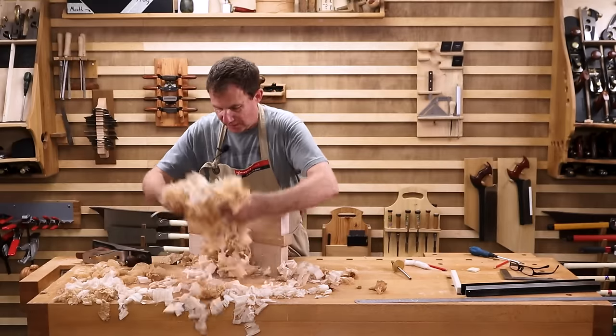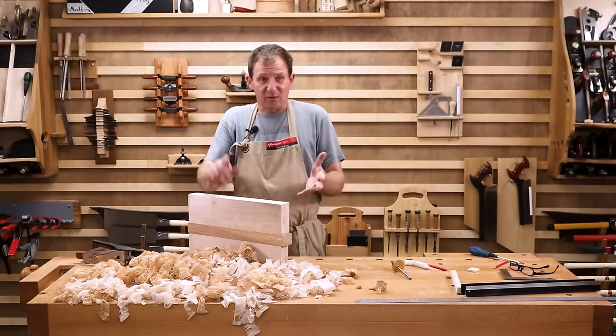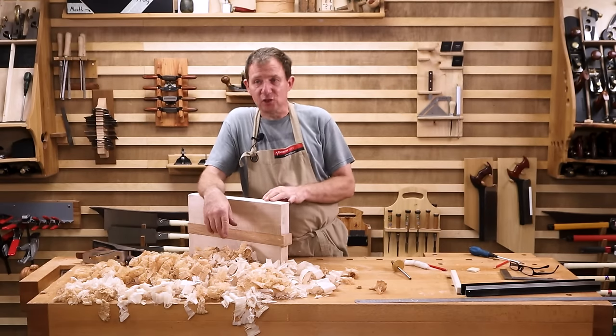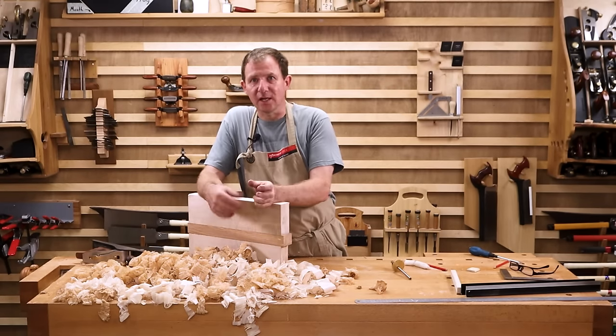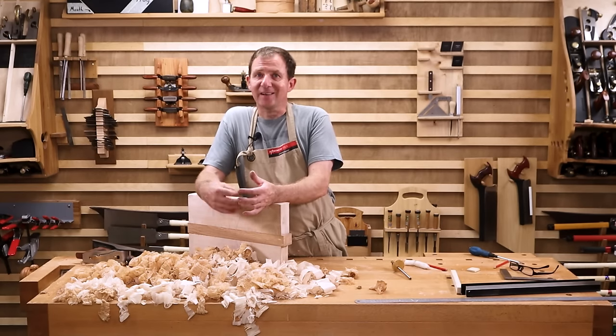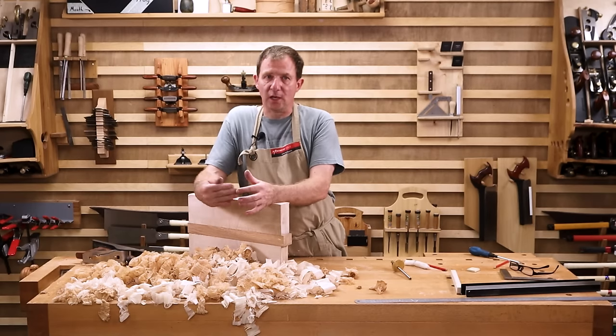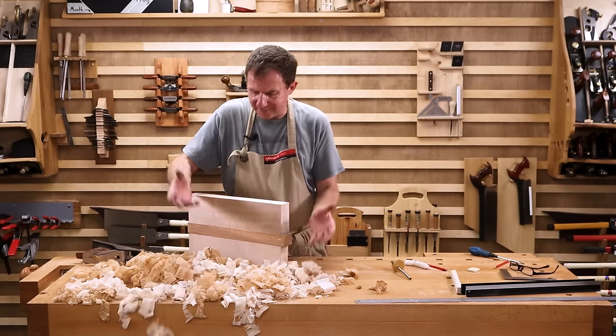So our shavings on here, look, okay? So getting quite fiddly. Major thing with this, keep that plane sharp. Have I sharpened it? Yeah, I have. Okay, in between cuts, especially if we've gone from the sycamore, then to the oak, then back to the sycamore, I need it nice and sharp. All right, the oak definitely is more resistant, so you need to just touch it up. We've done lots of videos on that, so quite easy to do.